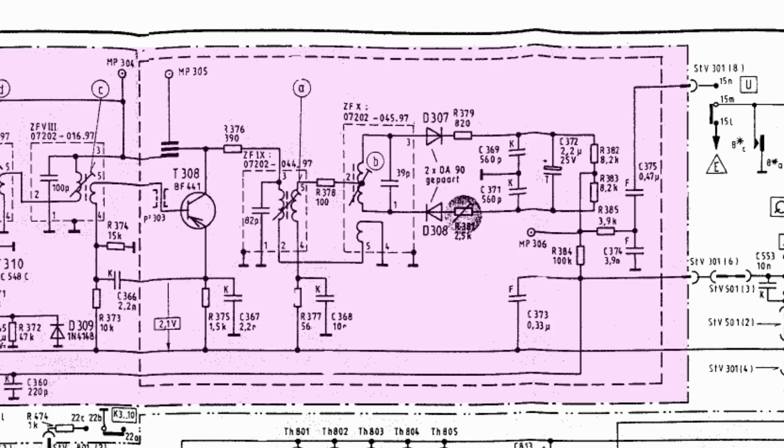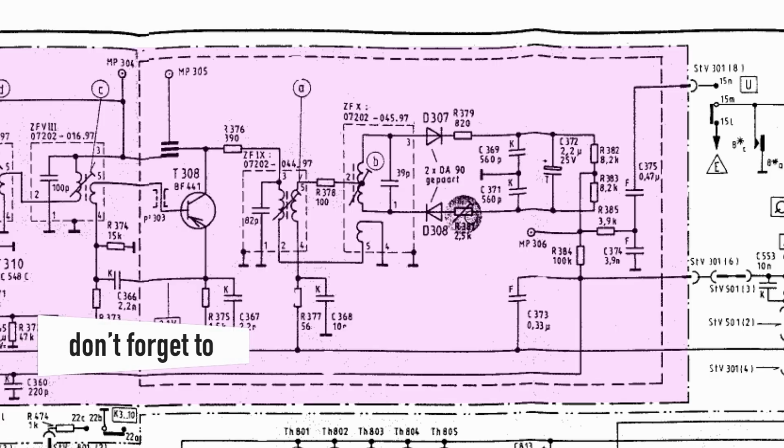And if you look at the way this thing is done, you've got the two diodes, one there, one there. And when you're adjusting B, you're basically balancing that coil over there so that the signal arriving here to be, let's call it rectified, on this coil is at the same position relative to each other. Then we also have a resistor over here of 820 ohms. And because those diodes may not be exactly the same, they add a trim pot here.